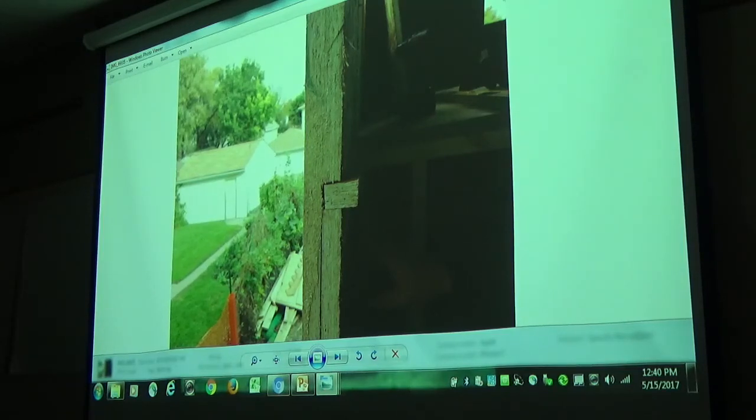But that piece below that, right here, subfloor won't be there, right? This piece right here, correct. Because that'll be panel. This rim is board, but what you're not seeing, if I go down right here, you'll see another seam, that's the rim. So in the new house, that panel won't be there, we'll have to infill that, correct. So this all can get cut out, and effectively, this piece right here ends just short down here, 20 inches. And so basically you'll cut out that piece and you'll infill all the way down, right? You'll have two seams there. Okay.